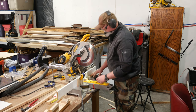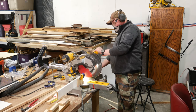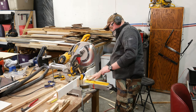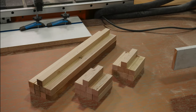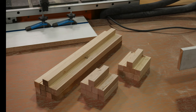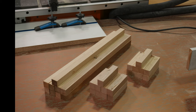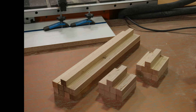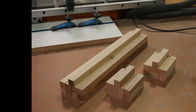For these wall sconces we went a bit on the big side, with overall finish dimensions of 22 and a half inches by 8 and a half inches by 7 inches — those dimensions include the plywood and finished trim pieces. For two matching sconces, you'll need to cut eight pieces each at 21 inches, 4 and a half inches, and 5 inches. It's always a good idea to cut an extra piece or two if you can spare the material. You can make these sconces whatever size you like — just be sure you don't go too small, because you still need to be able to reach your hand inside to install the light bulbs and attach these to the wall.